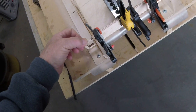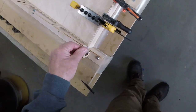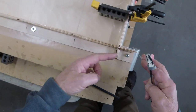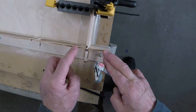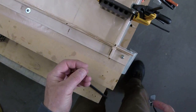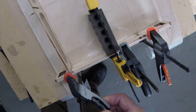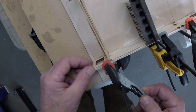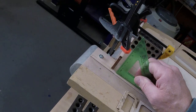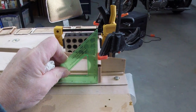I can see this is lifting up a little bit. Get a bunch of little 3/16 pieces ready — we're not going to put in any of the upper stringer pieces yet, but you do want this to stay in line and not push out of shape. Stick one in here and there if you think it's moving. Yeah, maybe it'll get a little glued in there, but you can carve that out later real easily. Nice and square, nice and square — okay, we're fine.